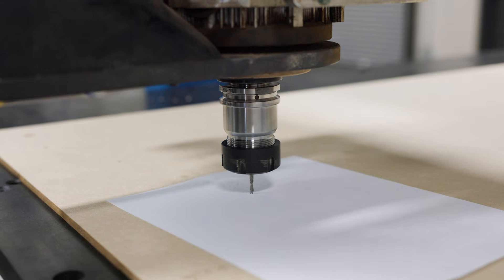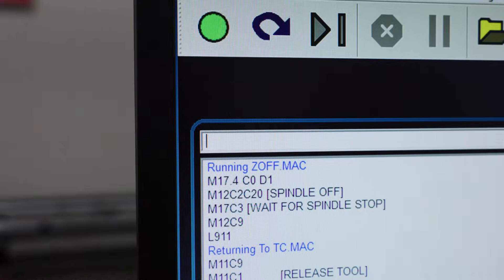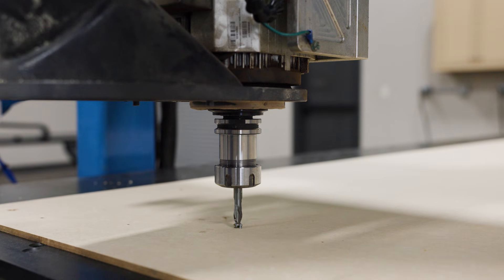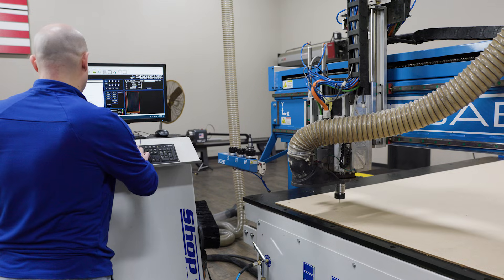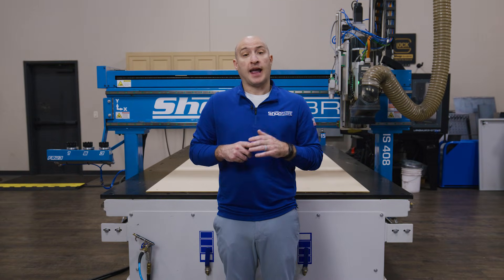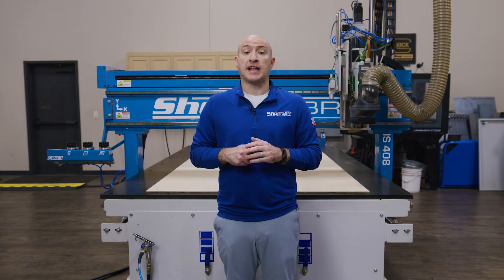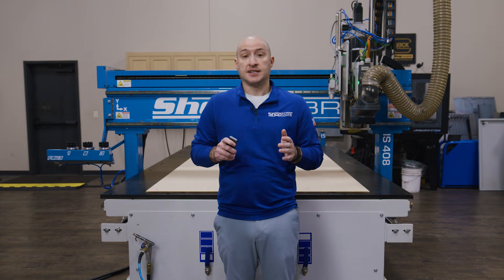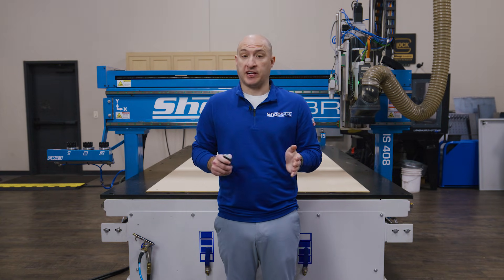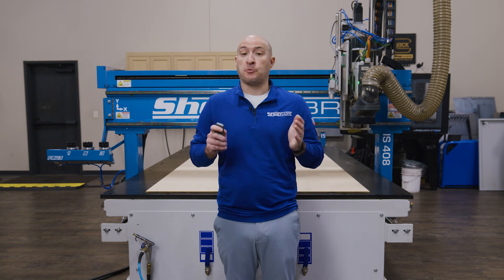From here, I will do this for each tool I'll be using for my door project to ensure that each tool is within the same accuracy as one another. Once I have done this with each tool, I can do a manual tool touch-off check to double-check the accuracy — I can tell any of the tools to go to Z0 to ensure they're all within the same location. Then I verify and adjust offsets as needed. When I compare the Z readouts from each of my tools against that zero, if any have a difference, even a few thousandths, I'll go back into the tool library and adjust the tool's offset value by the difference, subtracting the excess. This essentially recalibrates the tool length so that it is matched perfectly. By taking these steps, I ensure my tooling will be working at the same depth, which translates into better part accuracy.